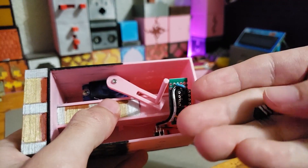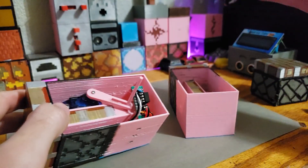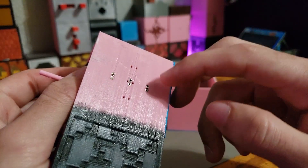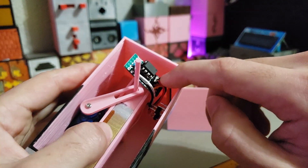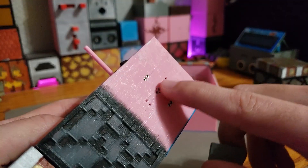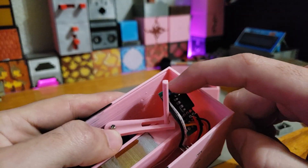In order to power the servo itself, it's using an ATtiny85. You can either have the module inside the piston or have it within one of these blocks outside and link it. The way the module works is that when power is supplied here, it will power both the servo and the ATtiny through this header right here. Once the ATtiny is powered, it checks this middle pin.